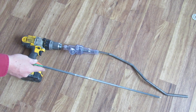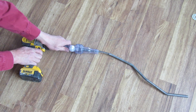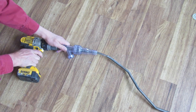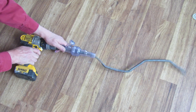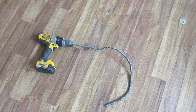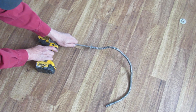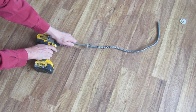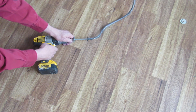This is the agitator, made from half-inch drain cleaning cable. It is long enough to reach clear to the back of your water heater. It is stiff enough to stir up the sediment, yet soft enough not to harm your tank, dip tube, or other components. You will notice there are kinks in the cable. These create turbulence and dig into the sediment. These can be re-bent to suit your needs. The most aggressive shape is perhaps the half circle. As you can see, there is no need to spin it at high RPMs. This thing is like a turbo-powered tornado in your tank.